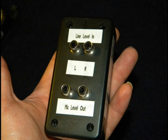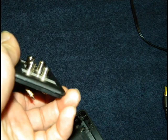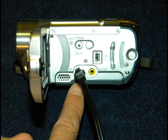An attenuation network is necessary, and if you look at this next picture, that's the attenuation network I built — it's sitting in my hand right now. I've opened it up and it's a pretty simple design — very few minimal parts. It takes a total of about eight parts and about an hour of your time. We used chassis-mounted RCA jacks on it, and the cable you see here is your typical MP3 Y-cable — the eighth-inch jack plugs into the camera. Now, techs will advise you — and I agree — do not use plug adapters such as a big plug to a little plug, because those jacks are printed-circuit-mounted and the weight will eventually put stress on them, causing solder joints to go bad and your audio to cut in and out.